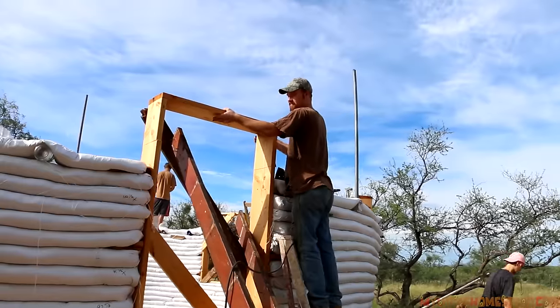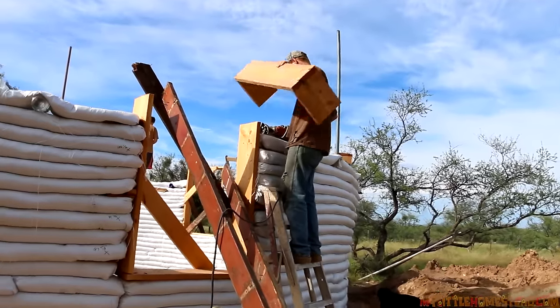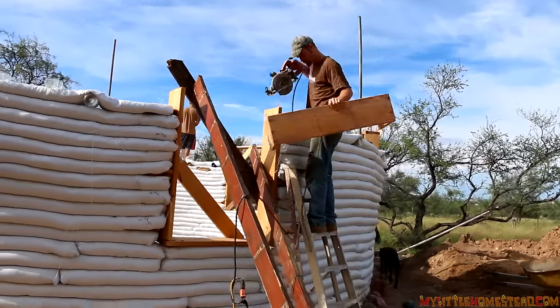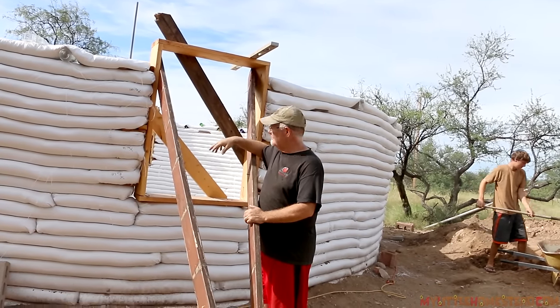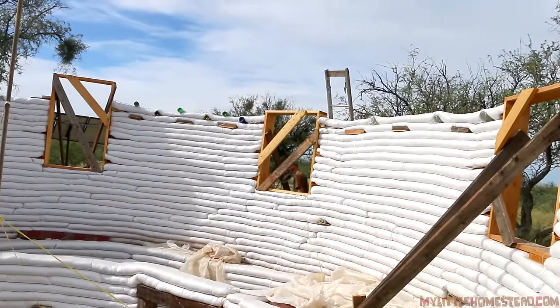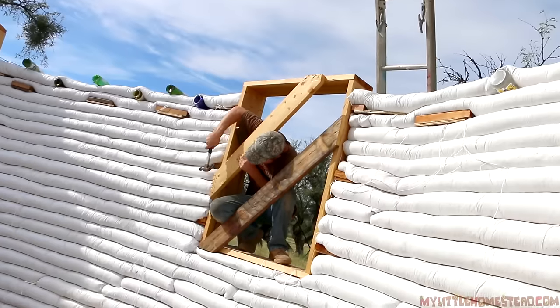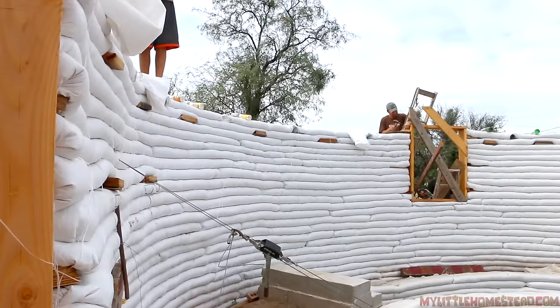One of the ways to help reach our goal sooner is to cut the top of the window boxes off. We wanted to go ahead and shorten the walls to accommodate the roof a little better. We've shortened our windows down from 4050s to 4040 windows — four foot by four foot. We decided to drop them down one foot, which brings the whole roof down one foot. Gives us a better profile on the building, and those 4040 windows are probably easier to find than the 50s.